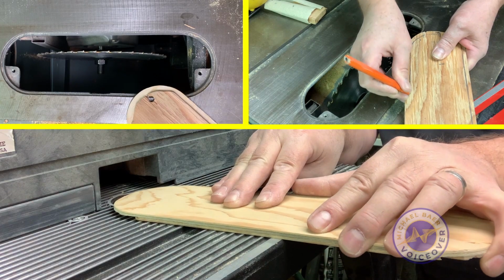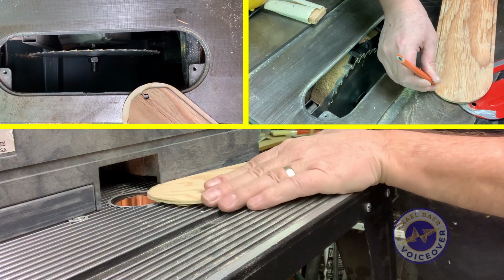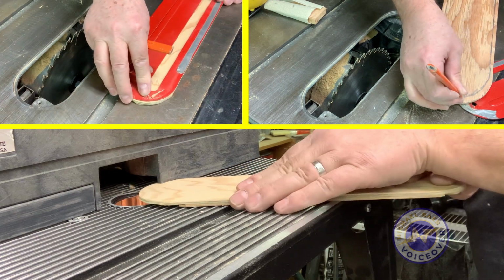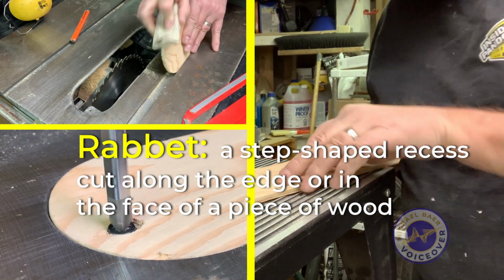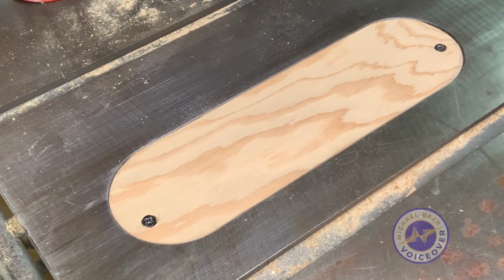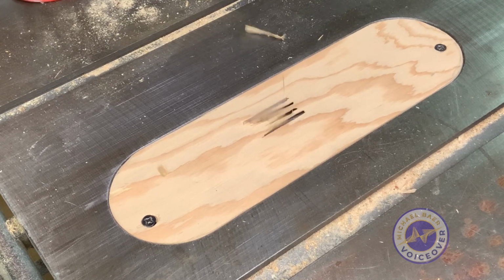I thought it was a lot more complicated, but really I happen to have a piece of 1/4-inch plywood on hand. I traced the template from the original steel insert, and I used a straight bit in the router to carve a shallow rabbet around the insert. A little fine-tuning with sandpaper, punched some countersink holes for the machine screws, and there you have it. The fun part was pretending I was in the wood shop on the Deep Space Star Freighter Nostromo, and it was showtime for the alien.